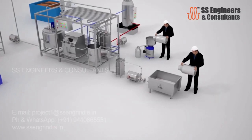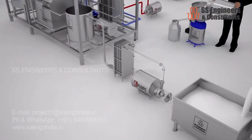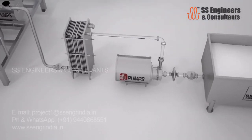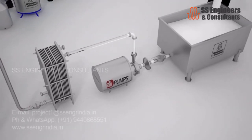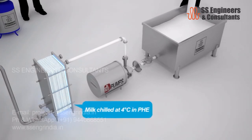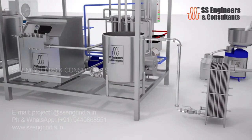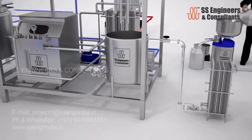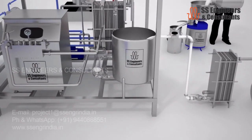Milk is poured to the weigh scale tank. The milk after weighing enters the dump tank, which is located below the weigh tank. The milk from dump tank is then sent to the raw milk chiller through SS centrifugal pump. The raw milk chiller cooled the milk from 35 degrees Celsius to 4 degrees Celsius in an hour through the help of chilled water circulation through SS plates. Here the milk is stored at 4-degree temperature till it is further processed.